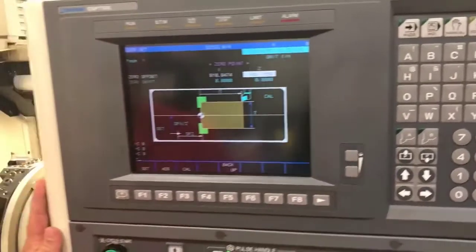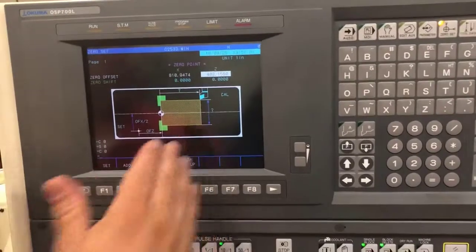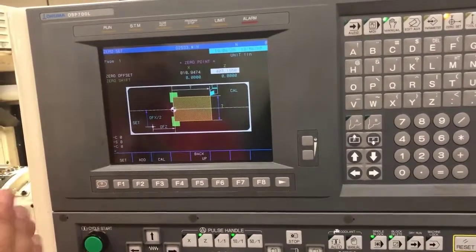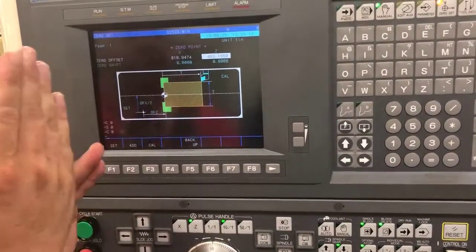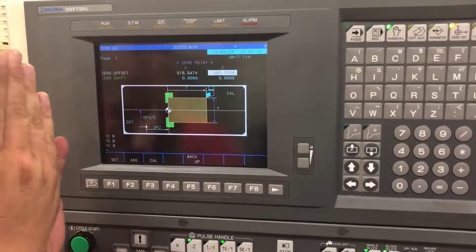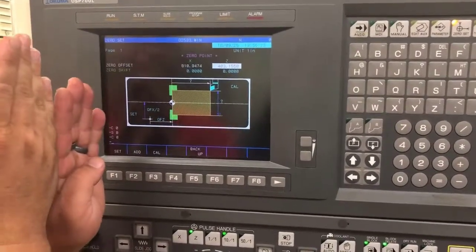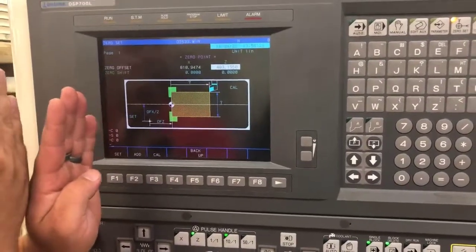The reason why I said to remember this is your main tool is because once this tool is set, when I turn it to another tool and bring it to the face of my part and set its location, it will only be the amount off from my main tool. If it is plus one hundred thousandths from where the main tool's location is, it will show a plus one hundred thousandths. Vice versa, if it is further in when it touches the face of the part, it will show as a negative. I will show you an example.